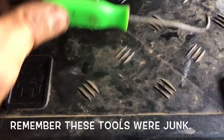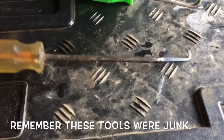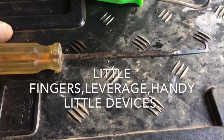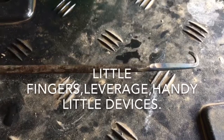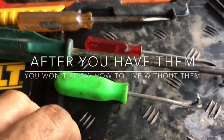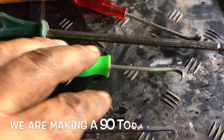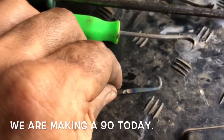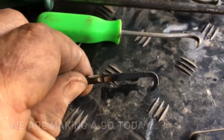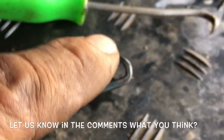Remember, that was just a junky little tool. Now this one here I've had for some time. Originally I had that as a point, but one day I needed a hook — a little bit longer of a hook than I had at the time. So I just went ahead, took it to the grinder and ground it down, put a little heat on it. If you're going to make a set of these and put any kind of bend in them, go ahead and take your propane torch or acetylene torch and warm them up. That way you don't break them off, because this is a hard metal — and I would suggest using safety glasses as well. I always dip them in oil so they don't rust, and I just put a little hook on the end of that.